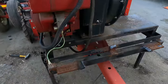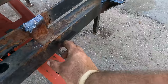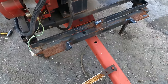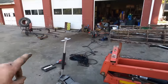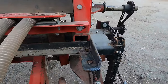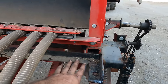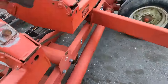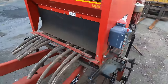I'm reusing some stuff out of my metal pile. Here's my old shear bar — cut that off, weld it right in the middle here, bolt through and through. We're gonna put rubber in between it so it cushions down and can flex some. On the back side, I got my three-point hitch pins that we just cut off — we'll have a plate come out, put the pin up and it will sit in here, and you just put your pin. We'll put a plate right here and then hoses run right out the back, probably run underneath this way to where they need to go.